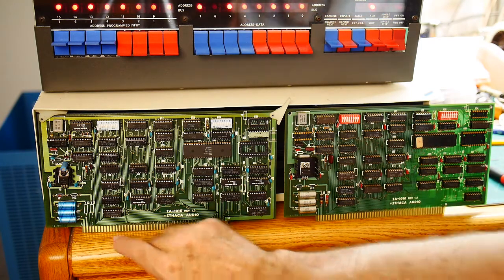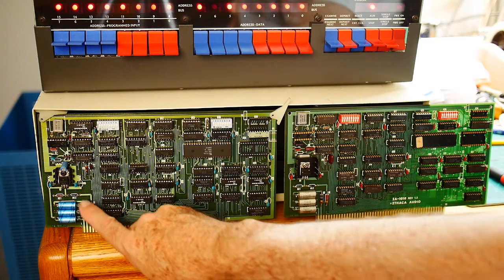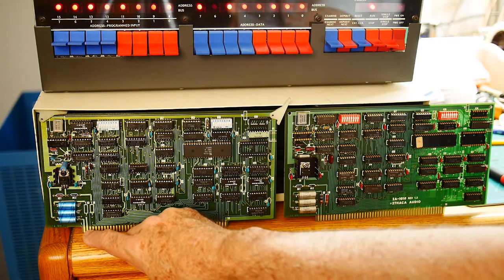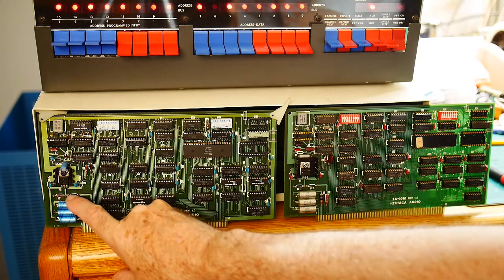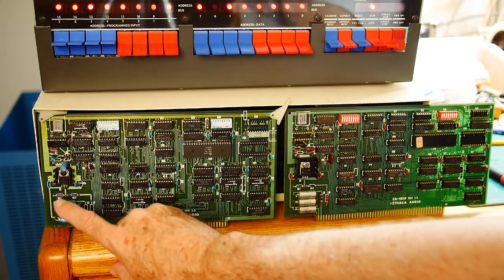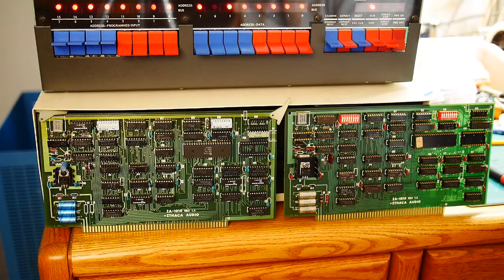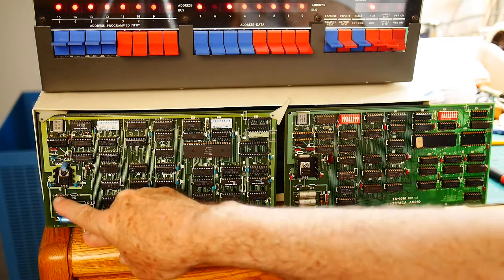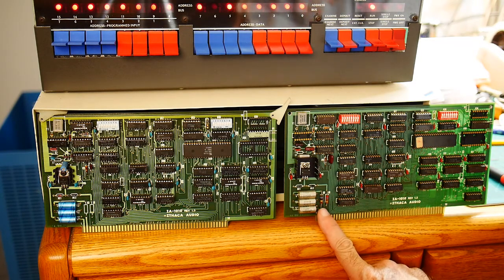But this card is missing some parts also. There are two load resistors for the plus or minus 16 lines, along with some Zener diodes. You need a resistor in series with a Zener diode to create some voltages - it's plus or minus 16 on the bus, probably plus or minus 12, or plus 12, minus 5, or whatever. Whereas this card does have the resistors.